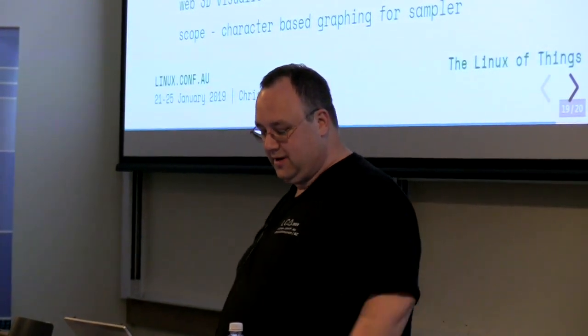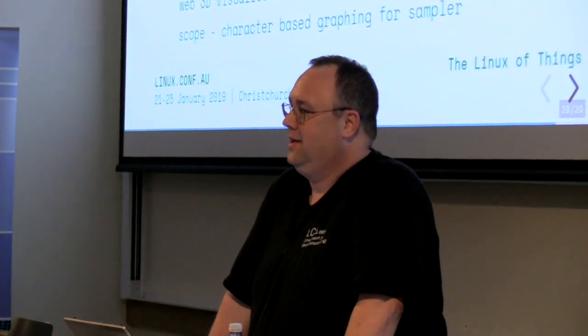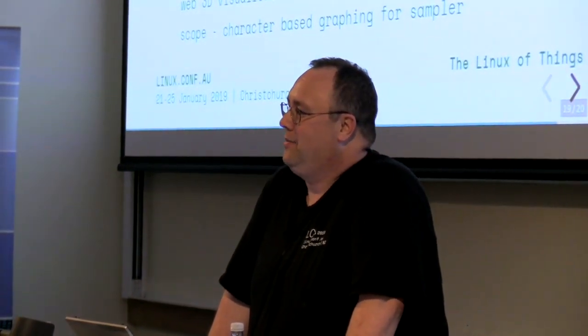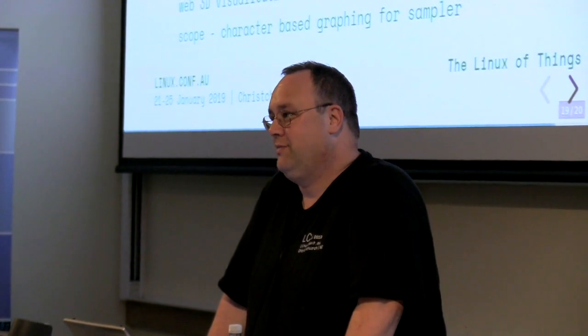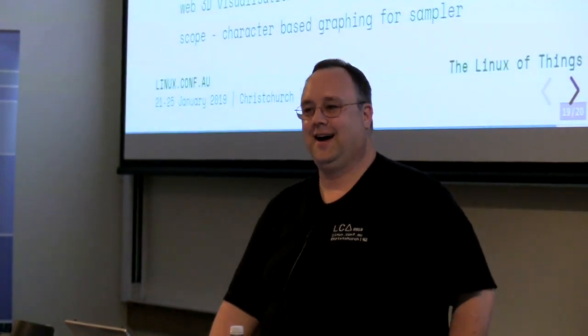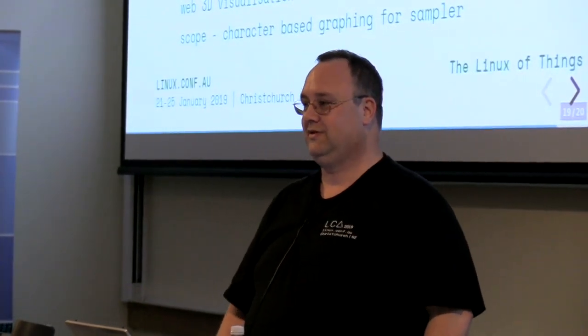And then the last one that I mentioned there is the time series graphing. That proved to be a godsend for my development of a system that was indexing a 400 kilo carriage 900 mil in just over 1 second. Without it, I wouldn't be able to do it. It was impossible because I just couldn't see what I was doing wrong.